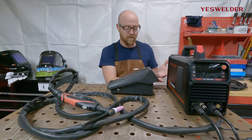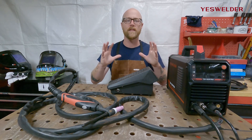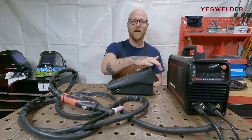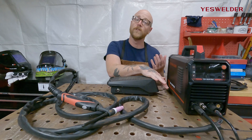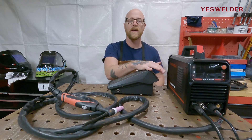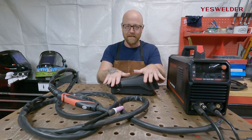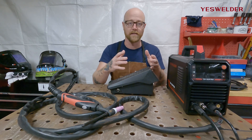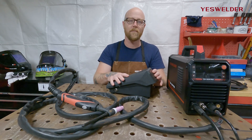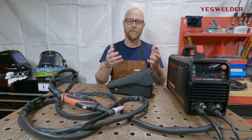This machine can run 200 amps. Let's say you set 200 amps for a big thick weld. When the pedal is at its resting position you're at zero amps; all the way down you're at 200. You can back off to 100, go three-quarters to 150, and really just read the puddle and input the necessary amps to get the desired effect. It takes a little more practice to get used to running a pedal while feeding rod and running a torch, but it's usually worth the time.